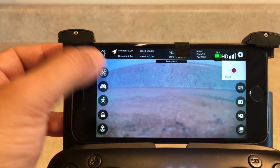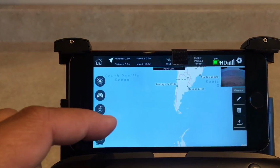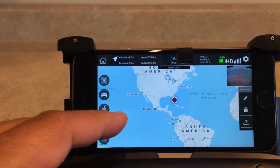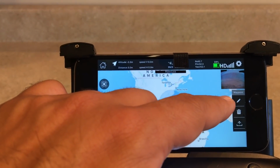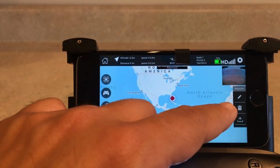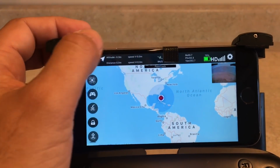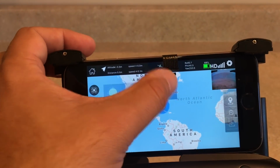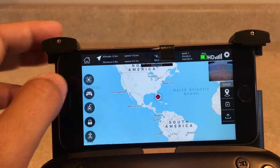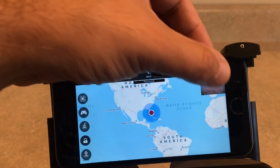And now going over some of these buttons, this will enable the special modes such as follow me, circle around, or the waypoint mode. And once in waypoint mode, you can mark your waypoints and then submit them and have the quadcopter fly those waypoints based on points marked on the map. And then you could set the follow me mode, or you could set the circular path mode here, and you just simply put a point and submit it and it will fly around that point.